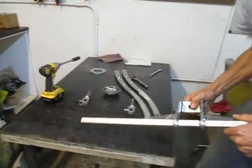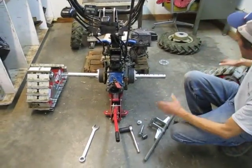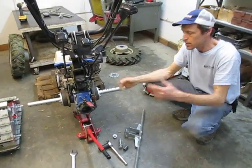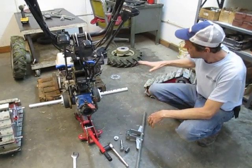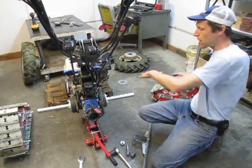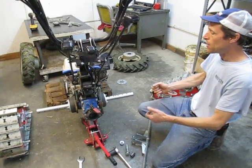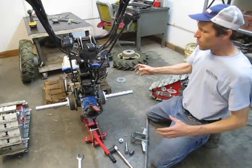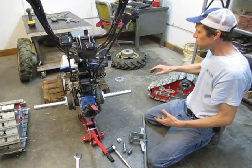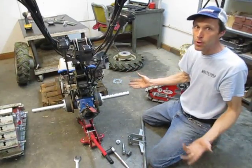The first thing we're going to put on is the brace bar for the back, and I'll talk about why it's here. I could just slide these tracks into place and start doing something like running a moldboard plow, but if these tracks don't have some kind of location limiter system, then as soon as you put the tractor in a really hard pull — say you hit a rock with a plow — the torque of that axle will find it easier to simply rotate the entire track assembly than to drive the machine. This triangular track starts to spin around, first crushing the muffler, then hitting the cylinder, and you're out of a motor.